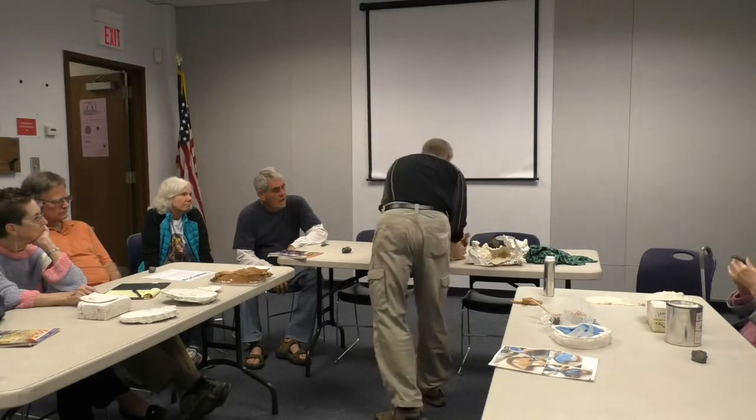If I wanted to do a molded plaster, it would have to be a part here, a part here, a part here, a part here. There would be many parts to the mold, not just a simple two-part mold like that. That would be really, really difficult. So flexible. So I had done some of those latex molds. I thought, great.